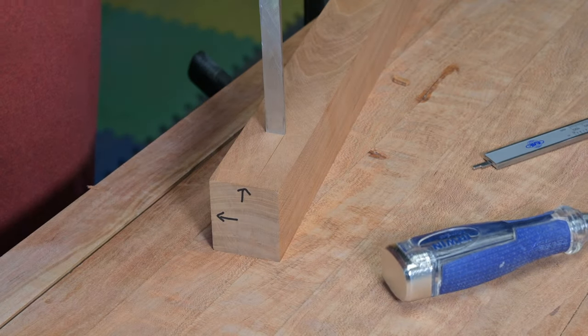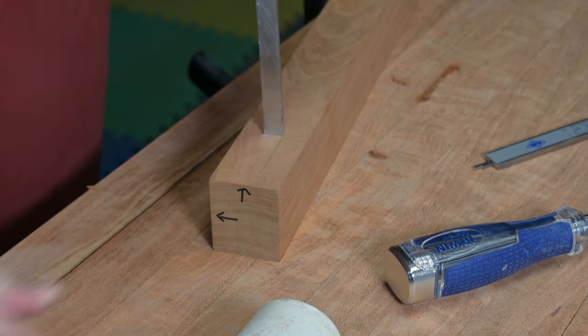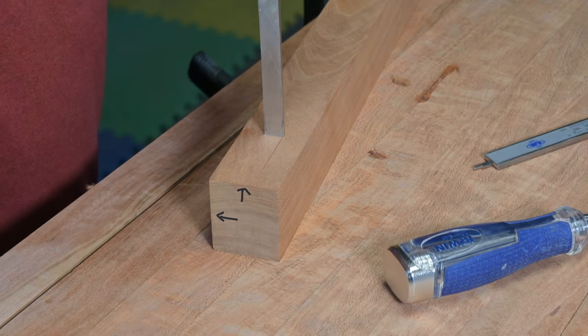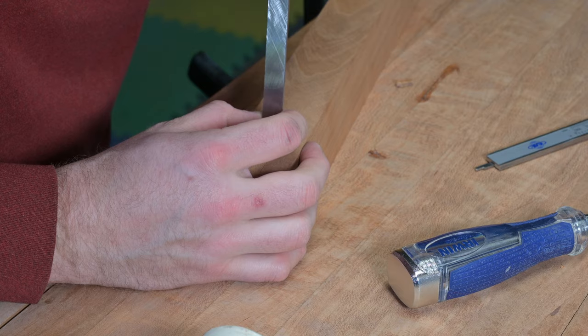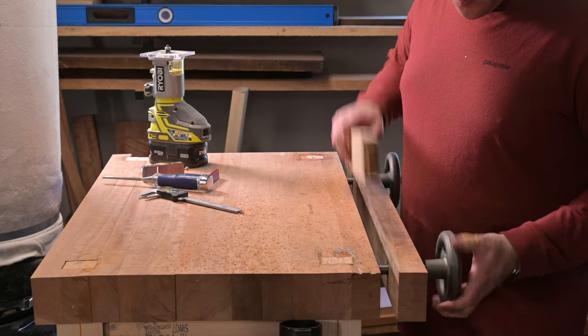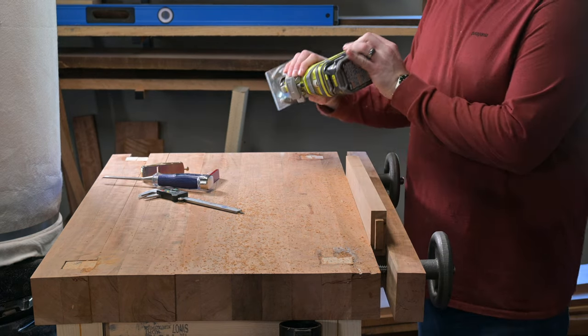While the tabletop glue dried, I began cutting the mortises in the legs to accept the skirts. I waited until the top was together so I could lay the legs and skirts on the top while it was drying to ensure that all my math was correct before proceeding. Since there would be two panels of glass in the tabletop, having the skirts end up too short was not an option. I then applied a half inch round over to the bottom outside edge of each of the four skirts to give them a softer look.